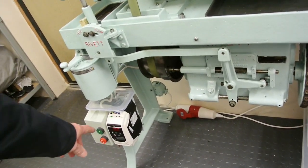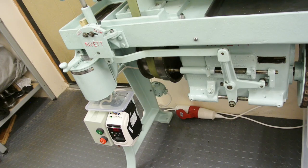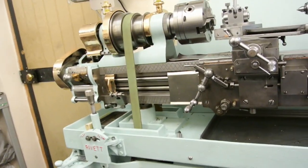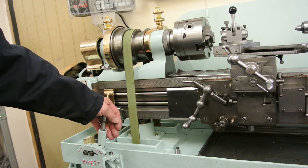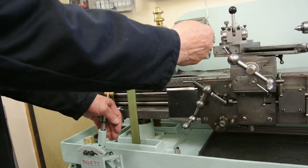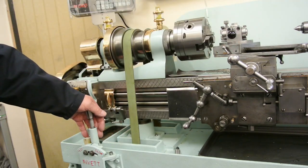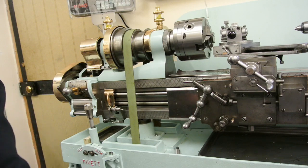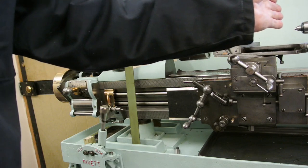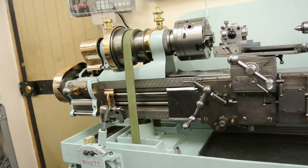Down below here I've got a frequency drive that enables me to switch into reverse. By pressing the green button while it's running, it stops the motor and then puts it into reverse. The method of operation is to constantly engage the gear train, move into drive with this lever forward, and when this is moved across it's retracted to its brake position. Then this is switched into reverse, moved back to drive position, and it moves back to where you start from.